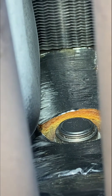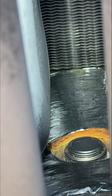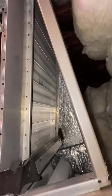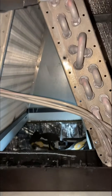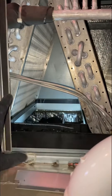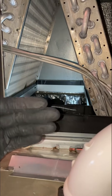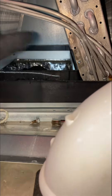You can see the back end of the limit switch right there, surrounded with insulation. The purpose of this switch is to measure the air temperature around the heat exchangers. If you have restricted airflow, a clogged evaporator coil, or zone dampers that failed in the closed position, it would restrict airflow, build up heat inside the furnace, and the switch would shut off as a safety to prevent overheating and cracking the heat exchangers.